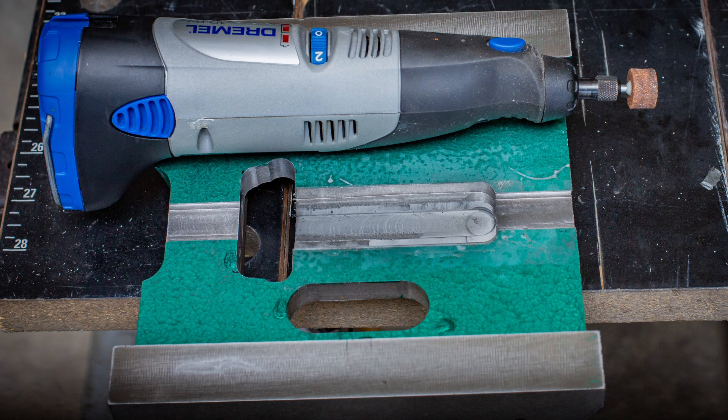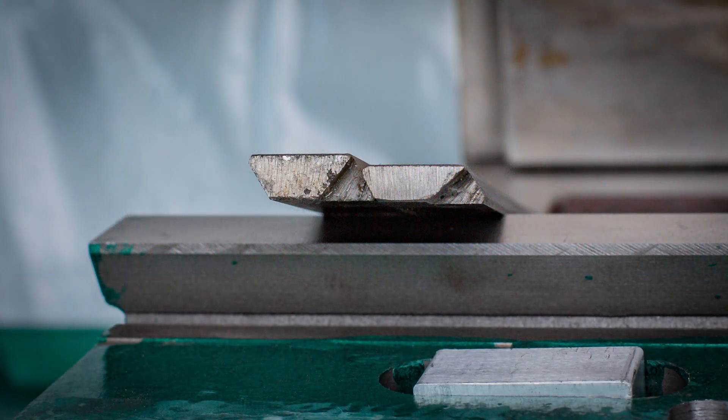Let's enlarge the slot and make the clamping block fit. Since I only have about a millimeter of material to remove I decided to use my Dremel tool with a grinding stone. When I was trying to decide if I had ground off enough material or not, the battery in my Dremel tool died and decided for me — turned out the battery had just enough juice in it to get the job done. Now that the clamping block fit properly in the slot it was time to install the gib.